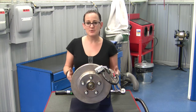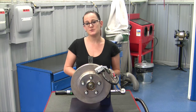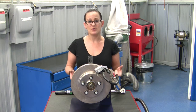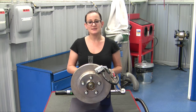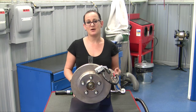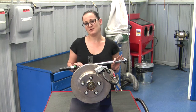Now there are a number of different things that can cause lateral runout. Flange face flex, which can be caused from using oversized wheels and tires, or a bad or worn out wheel bearing, or a dirty or rusty flange face can definitely cause it. Another thing that can cause it is curb impact, which will cause a bent flange, and even improper wheel and lug installation.